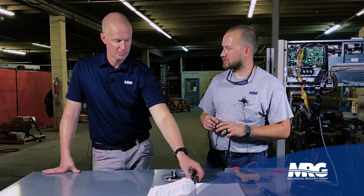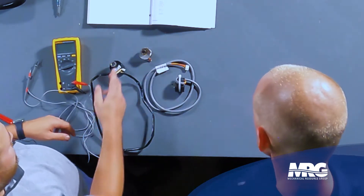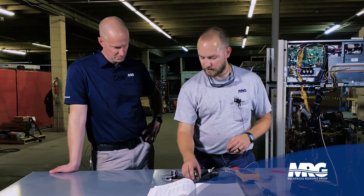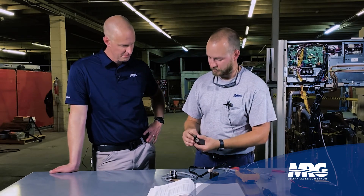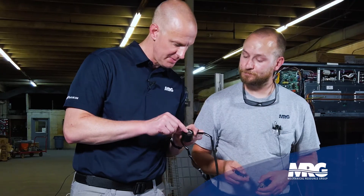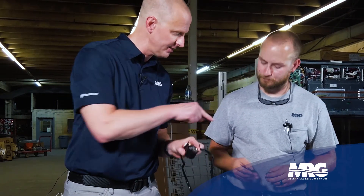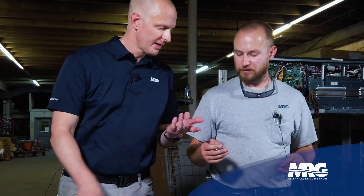After years of use — commonly on 10-year-plus VRV3 systems — moisture can get inside these things if the plastic cracks. That moisture binds up the gears. Here's a failed one where the stem is completely extended, meaning the valve is fully closed. So in this case, the coil was no longer flowing refrigerant. In forced recovery mode, the stem should be fully retracted — almost flush with the EEV head. If it's on an indoor unit and stuck closed, that indoor unit's heat exchanger is likely inactive.